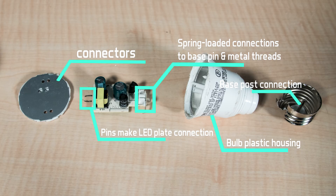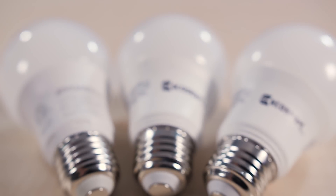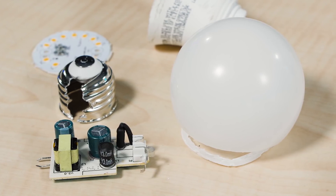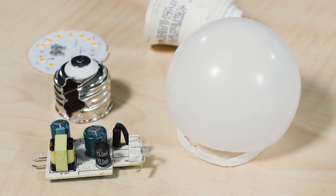Bright Power doesn't provide any details about the internal circuits of the LED driver chip. One detail it does provide is that the chip operates in critical conduction mode, meaning the current in the inductor goes to zero before the next switching cycle starts. Circuits that operate this way generally include a means of sensing when the inductor current hits zero, usually through a small sense winding used to detect when voltage has dropped to near zero. However, the Bright Power chip doesn't need a sense winding. The data sheet mentions a patent-pending MOSFET driving technique, which may explain its ability to operate in critical conduction mode.